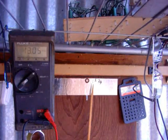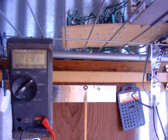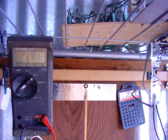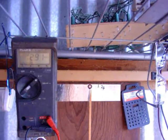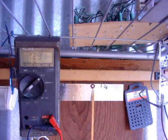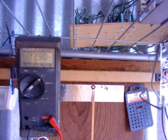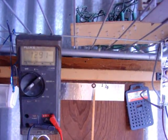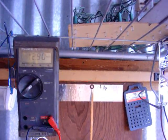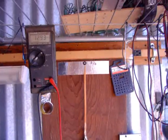The tape drive motor had two holes drilled at each end of the prop — they whistle just a little bit. I could hear when they cut in and got up to speed. I didn't care making a little noise; I like hearing it and knowing when to look up and see what kind of charge is coming on. But if you round the ends, round the front, and sharpen the trailing edge, they get very very quiet — especially rounding the tip. Props where I just cut them off straight without rounding the tips make noise. Every airplane propeller has rounded tips and that's the reason: to keep it quiet.